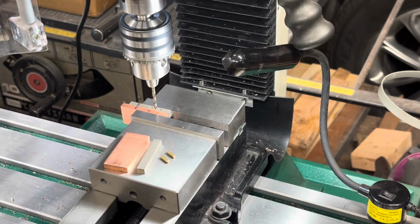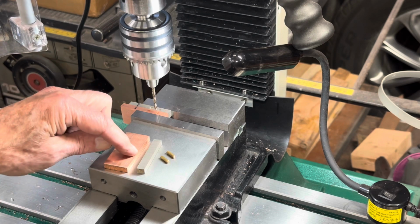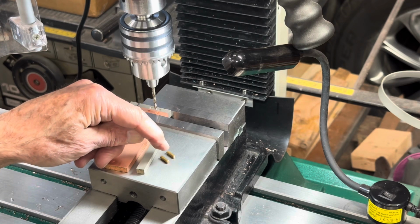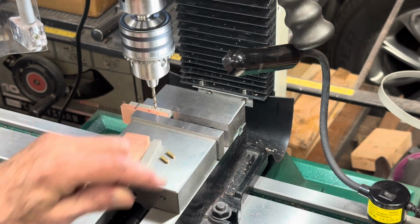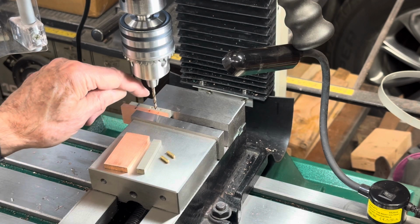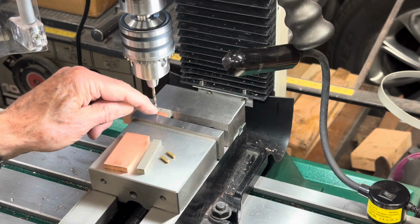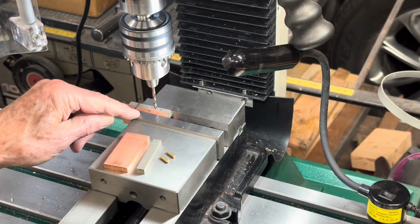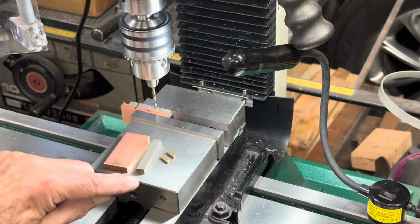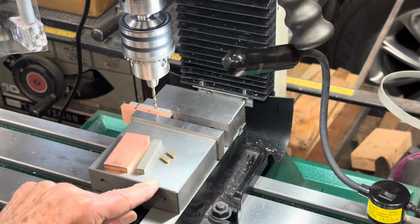I'm going to make a finger guard for my knife out of two dissimilar kinds of metals. I have copper and I have nickel, and I'm going to pin them together with brass pins that will be hidden. So in order to do that, on the milling machine, I mill 2 holes on each piece of metal, the exact same distance and depth. And then I epoxy them together and pin them with brass pins.